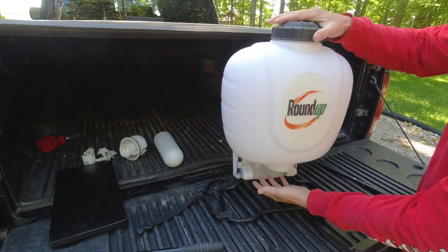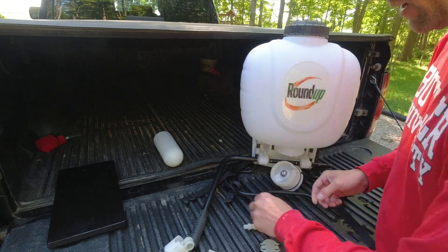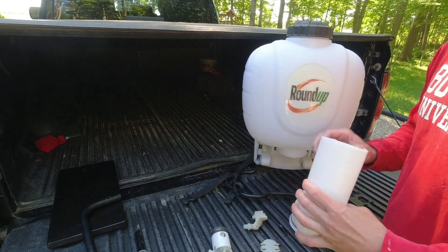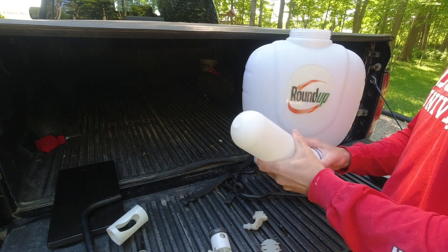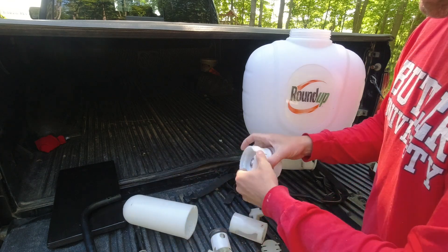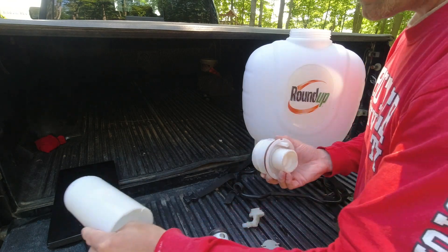So if you're familiar with this pump or any pump, there's often a whole lot more going on down here. I've already disassembled it — yours might look something a little bit more like this, with a couple other pieces hanging off that I've cut. Basically any little bolt you see in here, you need to take off and start pulling the arm off. You can pull the rod out. The plunger will have been up in here, kind of helping hold it in, so you pull that down out. The big piece of any of this is that you need to take the guts out of it. On this one, before I cut it, this was all one giant piece up inside the tank — you pull it out from the bottom. On this Roundup one, I simply took a hacksaw and cut the top off. This was also on the bottom kind of sticking out — do the same. Just make sure your cut is below the outlet, as this piece is important — it's where all your chemicals will come out.